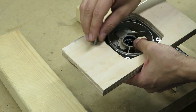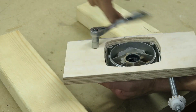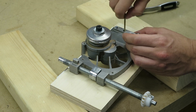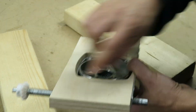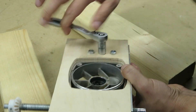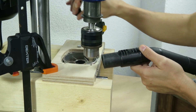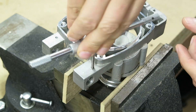In one of the sides I used the already existing tapered holes to fix it with bolts. On the other side I had to drill the metal and tap it with an M4 tap so that I can use 2 more bolts.